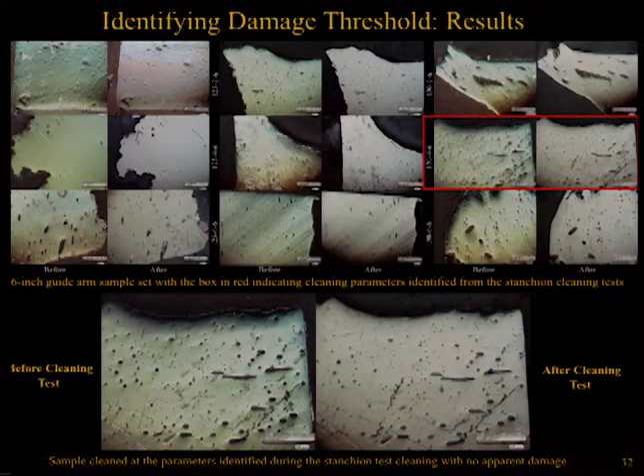The sample cleaning procedure took place in three phases based on the successive attachment of each guide arm. Starting with the 3-inch arm, the SDI Select 60 was set at 100 psi, and the first series of samples were loaded into the mounting platform. The blasting unit was set to produce two pounds of media, and the corresponding sample was hit by short back-and-forth paths of dry ice to simulate an actual cleaning scenario. Media volume was then increased to four and then six pounds for subsequent samples. After completing each series, pressure was increased to 125 psi and then 150 psi. The results showed little change to the metal surface on all samples regardless of pressure, volume, or blasting distance. The only alterations identified occurred within some slag inclusions where material appeared to have been removed, with minor metal loss observed around the edges of several affected inclusions.